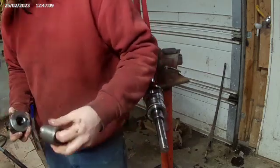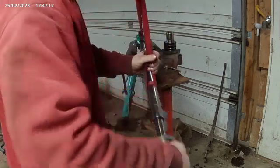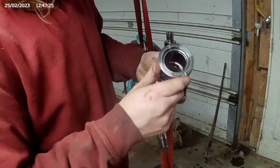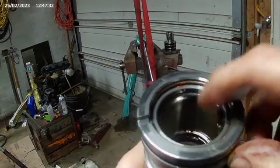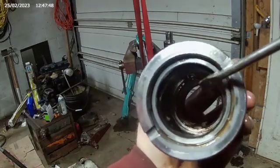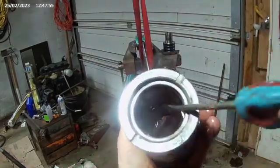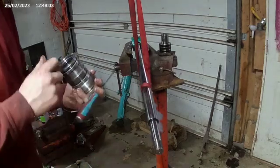There's your cushion valve. Make sure your piston doesn't slide off there — it's all going to go back in the same direction too, don't forget that. Let's see why this thing is leaking. Let me get behind here and look down in there — you can see right there that there's chunks missing. You can see the seal down in there; I wish the lighting was better. It's just blown out there — that's supposed to be a piece of the seal. Just dry rotted. But we'll get new seals.